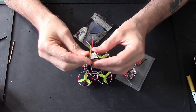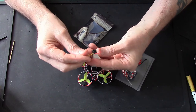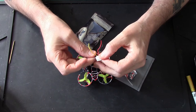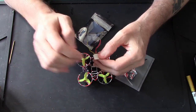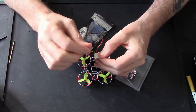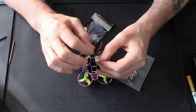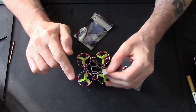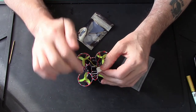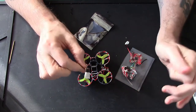Well, I've got my little nano receiver, and I just need three wires this time: your ground, your red, your 5 volts, and the next one along is your TX. You wire it up there because your TX also works as S-bus. Now, that might sound a bit confusing if you're a new pilot, so I'll leave a link in the description to a video I've already made about different ways of wiring up the little nano receiver.